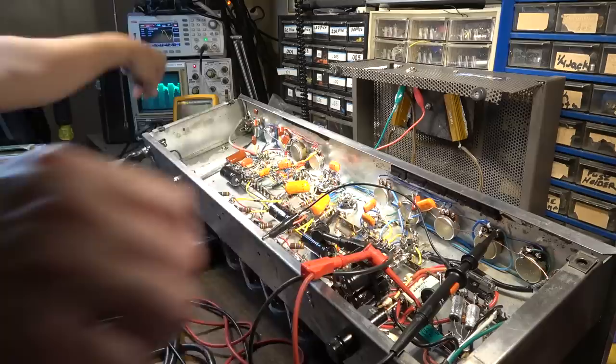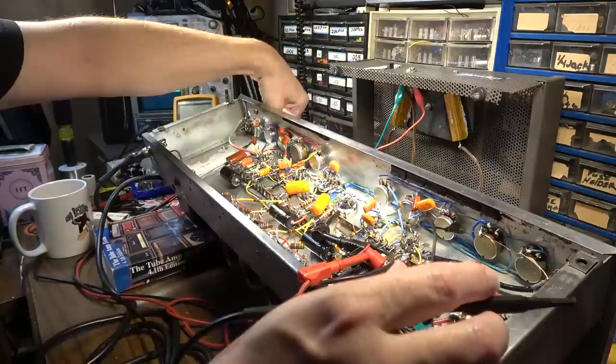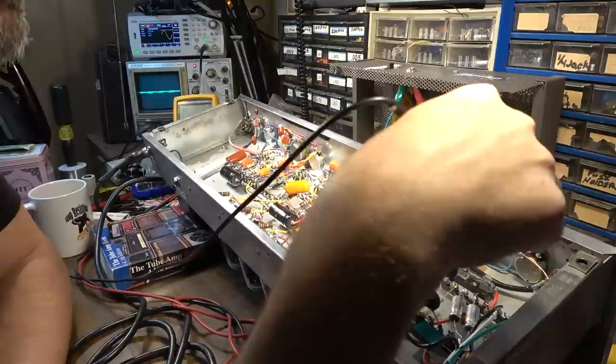Okay, so we've got good signal right there. That's coming out of the gain control. So we seem to be okay there for the most part. But there is a lot of noise or something going on in that channel. I don't know if we have a bad tube on this channel, but something is certainly not right. Okay, so anyway,